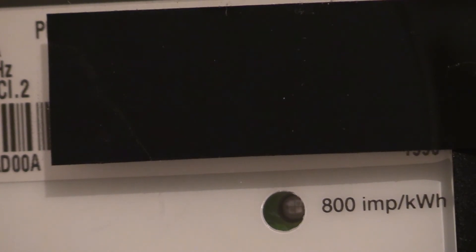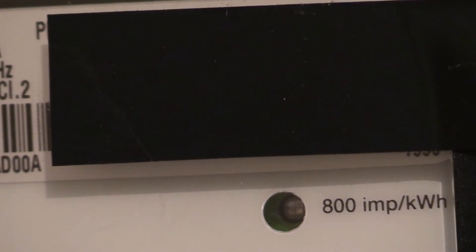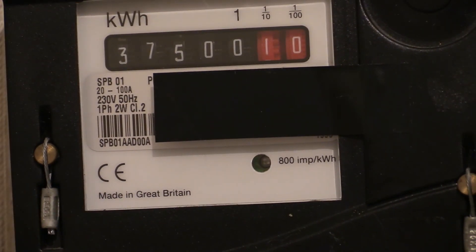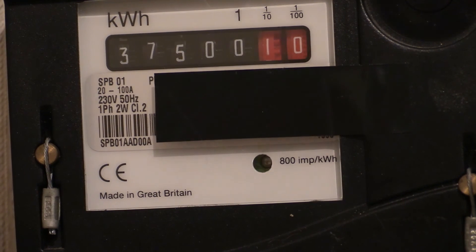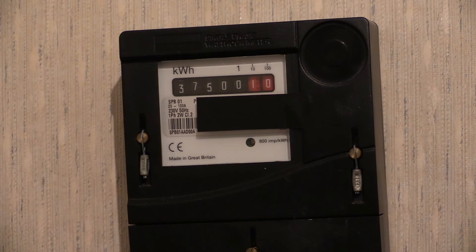Okay, stop it there. So that was actually missing one pulse. We wanted 80 but we got 79. I'm going to throw a little chart or table up on the computer screen right now so you can have a look at what the fast speed was, what the ideal speed was, what the slow speed was, what we got out of that in this test, and whether it passes or fails. If it passes there'll be a big green box, if it fails there will be a big red box.